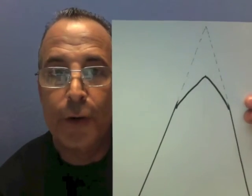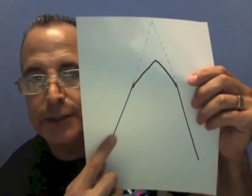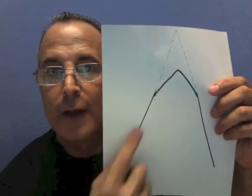Also, what I wanted to say regarding the micro-convexity and a touch-up: the only way that you can really do a touch-up, as most people would think of it, just to bring it around a little bit, is you would have to take a pasted strop, because a pasted strop is the only thing that will go around the corner here. The pasted strop will give you that little bit of touch-up. You can do a few passes on the pasted strop if you want to. I understand people do that. In my case, I use natural stones. I don't mix the pastes and the natural stones. If I do one of those types of edges, a CBN edge, I'll do that. But that's just my personal thing as far as what I want to do.